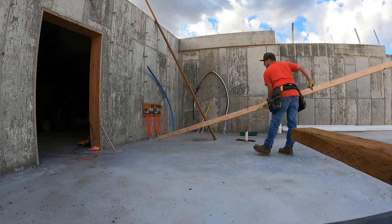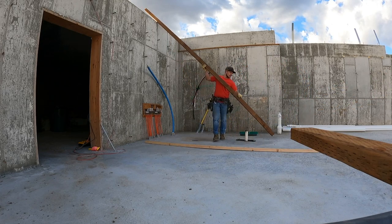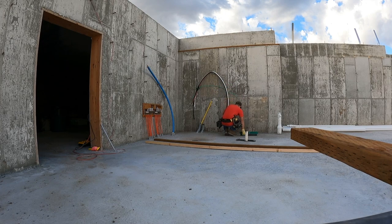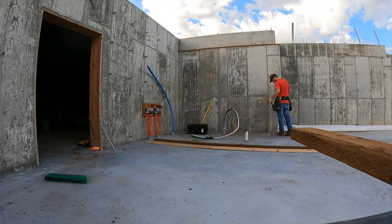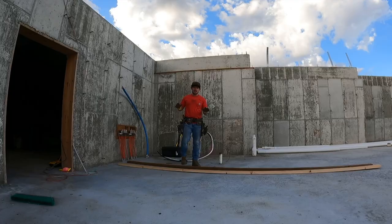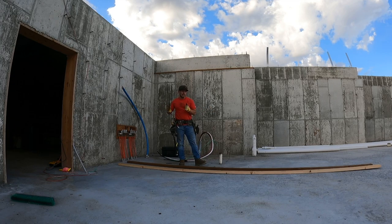Top plate. This will be our bottom plate. In the meantime, we are going to clean out this corner just a little bit. Now we can throw a tape on, measure out. Should be the same as on top, but you never know. As far as the layout on this wall goes, it's pretty straightforward. We're going from that corner to that corner. It's 130 inches, so we're just going to lay out 16 on center.